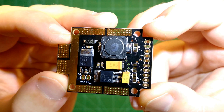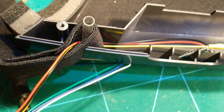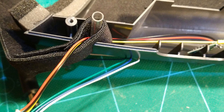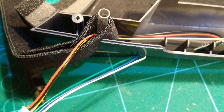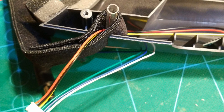I used the Daemon Core PDB for this, but other PDBs with LC filtering on board might work as well. Here you can see how I passed the DVR cable through the head strap to the outside. I only connected the red, black, and the yellow video cable, since I only use it for recording. If you use a video switch here, you can additionally use it for playing back your recordings as well, but I found out that I don't use this feature, so I have not connected the other cables.